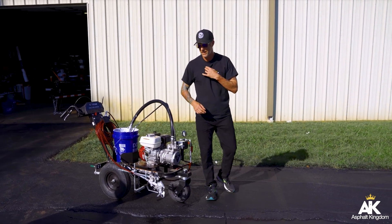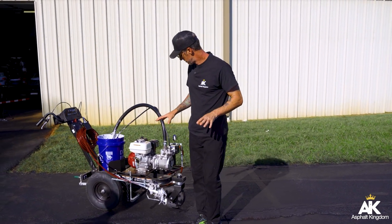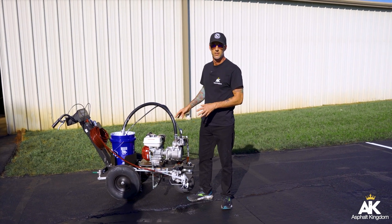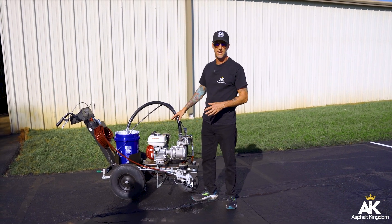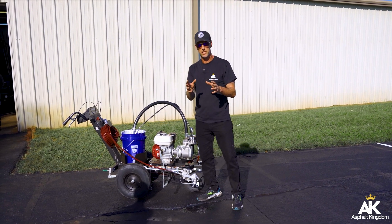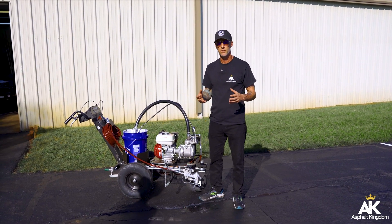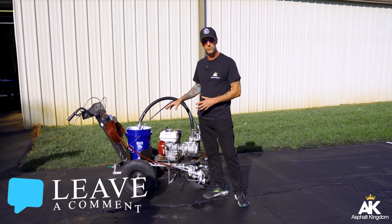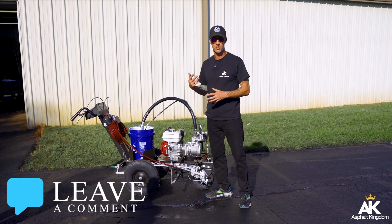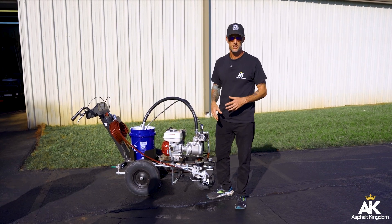Just to be clear on this complete unit: Titan does a great job at preserving the unit with the grease that's inside the inlet and outlet valves, but it can cause you problems as it relates to priming your unit and getting it going. We did have that challenge with the Powerliner 3500 from Titan. What we learned is that after much time, that water circulating through the system cleaned out the grease.